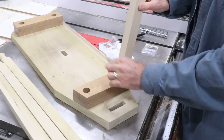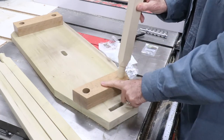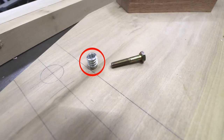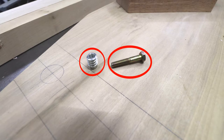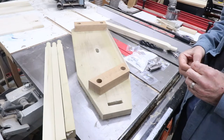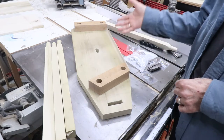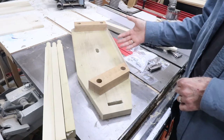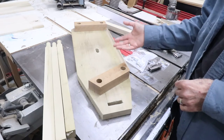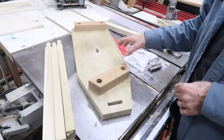To bolt this down we're going to use threaded inserts and quarter-twenty bolts. The quarter-inch inserts have quarter-twenty internal thread, they're for hardwoods, and the bolts are grade eight. Why grade eight when grade five would probably work? What you buy at Home Depot is barely grade five — most of it is barely above grade two — and that gives it a chance to break or fail. Don't want to deal with that.